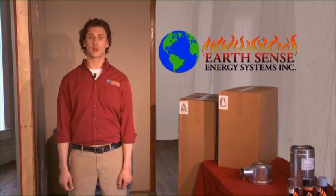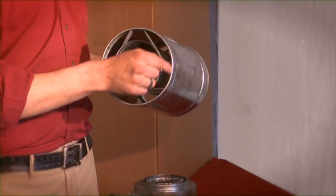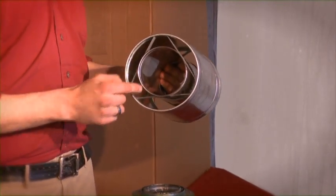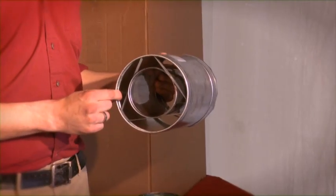In this video guide, we're going to walk through the most common installations with our direct temp venting. Direct temp venting is a single pipe design that incorporates both outside air for combustion as well as expelling our flue gas exhaust. By drawing our outside air with the same venting, we are preheating that air before it enters the stove. We offer two venting kits.